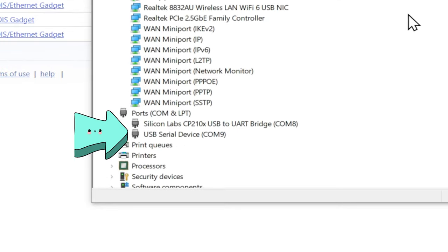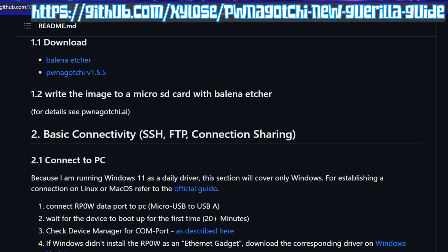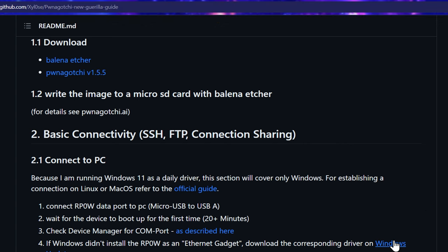Here we go. It popped up. Now, it actually popped up as the wrong device. It says USB serial device. That is the incorrect device, but luckily we have a place for drivers. I'm roughly following the Pwnagotchi New Gorilla Guide by Xylos, I believe it's pronounced. We've got the link down below in the description, and they were nice enough to actually give us some drivers.